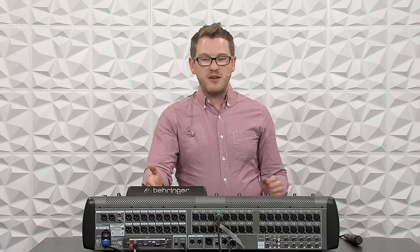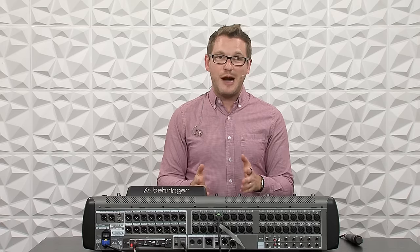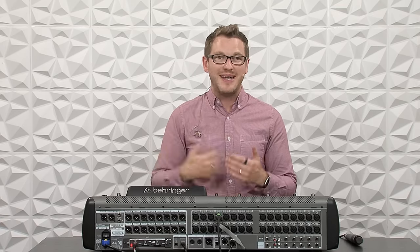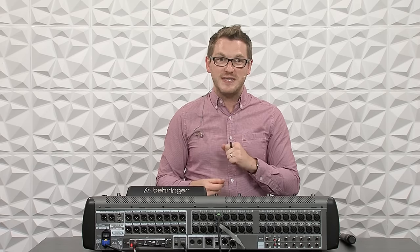So that's one of the benefits of applying some delay to your floor wedge when you are ringing out your floor wedge. But once we are done with that, we will want to make sure that we uninsert that delay. As you could tell when I was talking there, it was a little bit weird to talk into the microphone and then 100 milliseconds later, hear my voice again.